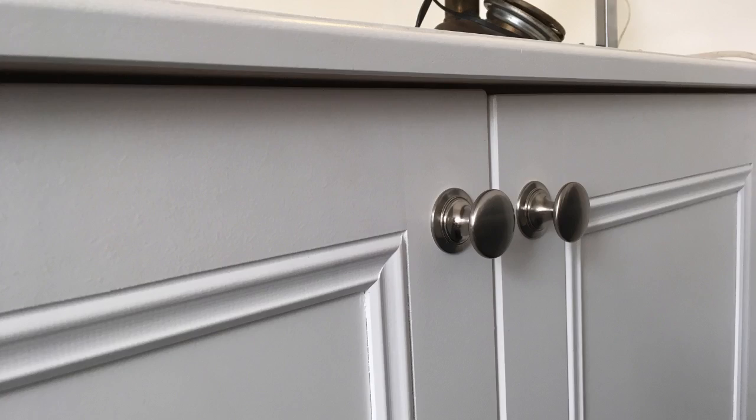This project was fitted just around the point when we were getting into spray painting, but we hadn't moved from the Leyland and Johnston's decorator type products to the Movac products that we now use. So we'd started spraying the products we used to hand paint, and we were just starting to realise we could probably do better in terms of spray paint. So it was interesting for me to go back and see it. Also, it was the 5-piece door style that we've always used up until we started experimenting with CNC. So just quite interesting to compare the level of finish to what we now get.